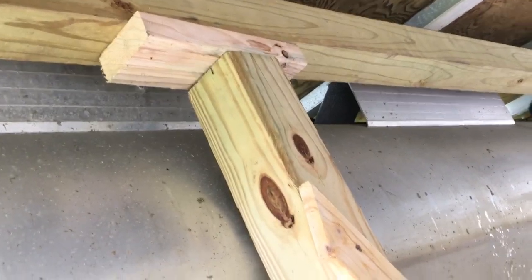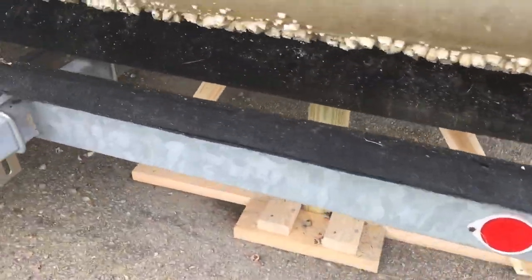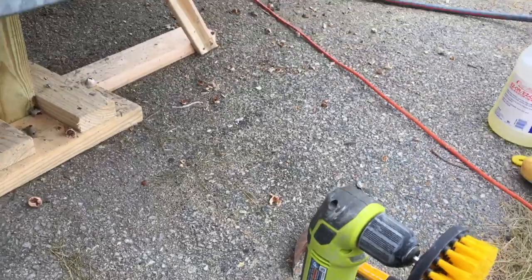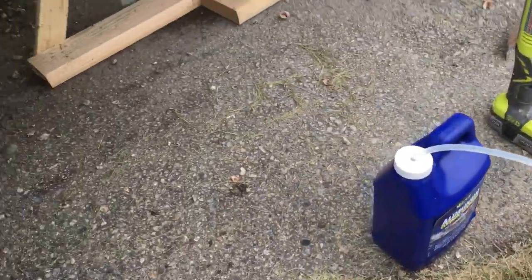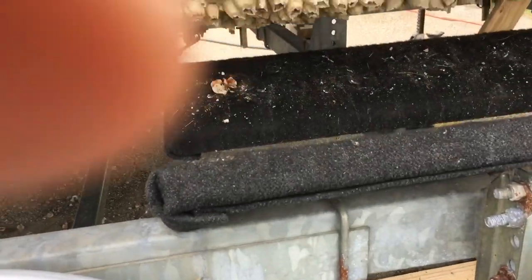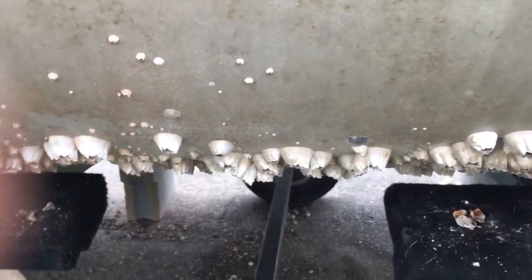From the starboard side you can see all the calcium deposits that have been removed from down below. You'll want to use safety goggles, neoprene gloves, and maybe some additional gloves to make sure you don't get any chemical damage. It's simple enough to do — I'm going to start right here just to show you what actually happens.